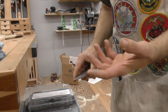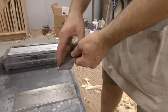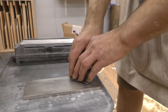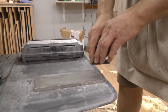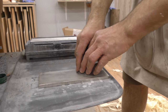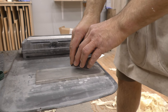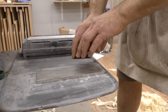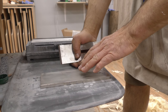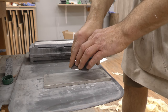Your grip needs to be light to moderate — very comfortable. The stone doesn't need excessive pressure to cut; it'll cut with just a little more than gravity acting on the blade. And I can actually feel what's going on on the stone. If you push excessively hard, you can't do that. As you learn to do this, you'll understand you can actually feel it cutting. If I were to illustrate somehow, I would say think about how much pressure it takes to just start to compress a firm grape — that's about how much pressure you're wanting to apply with the blade on the stone.